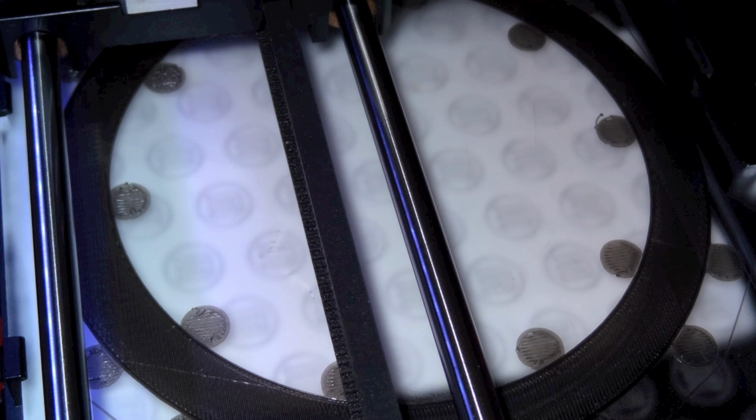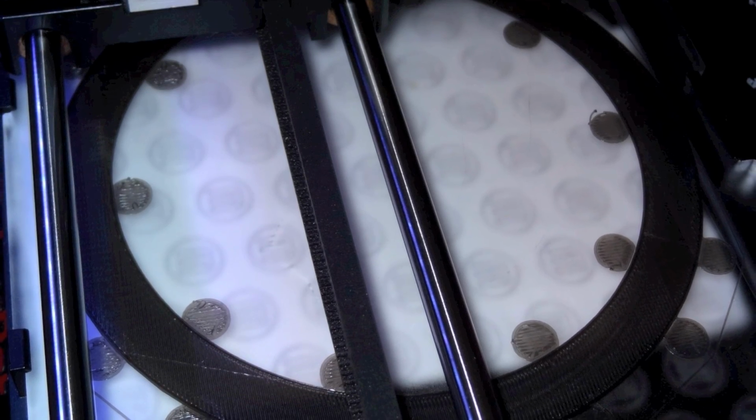stay quite okay. One of the problems with the acrylic build plates is if you print really large parts on them, they will tend to actually bend up with the part as it contracts as you're building it up. So far it actually hasn't warped that plate, but it still causes the parts to bow a bit.